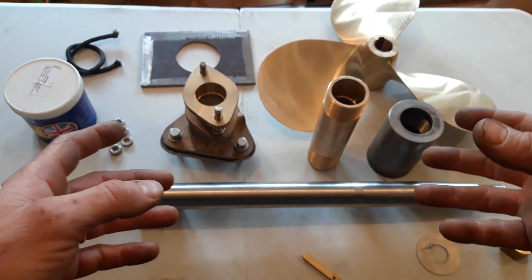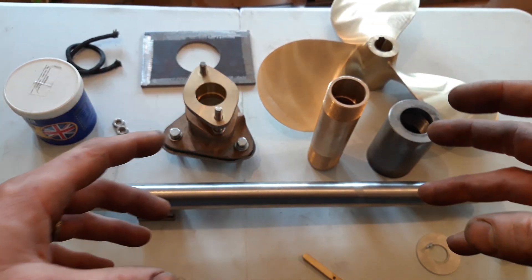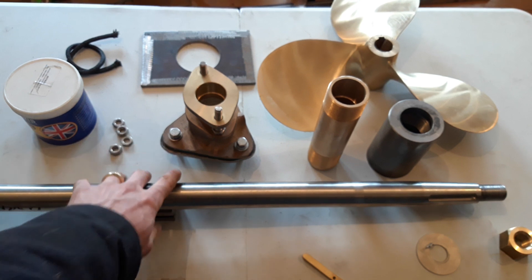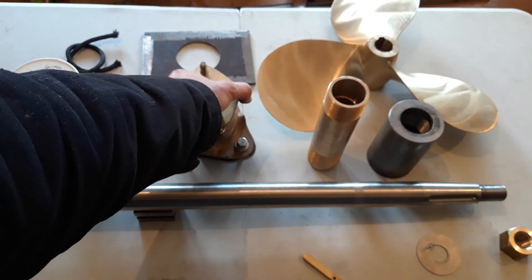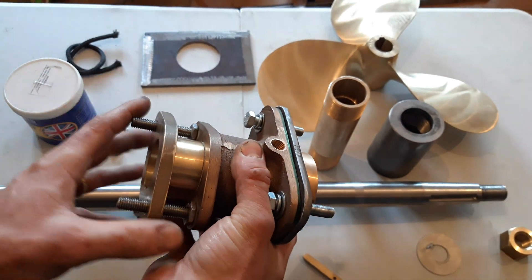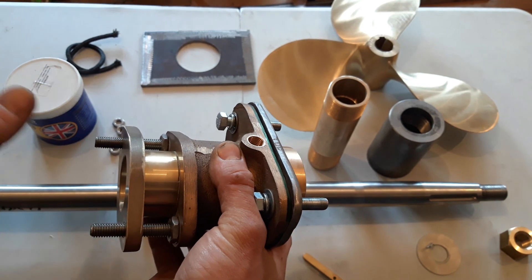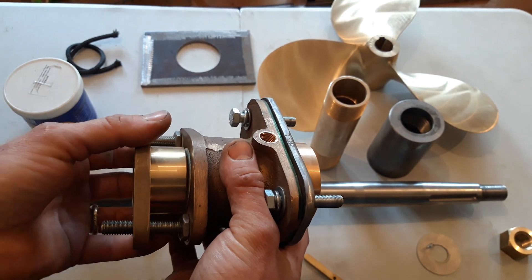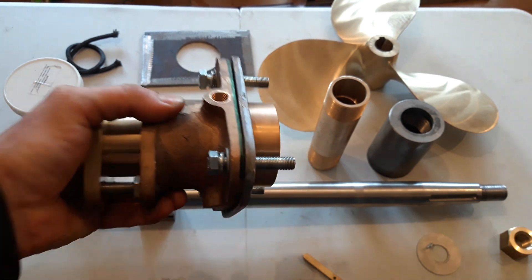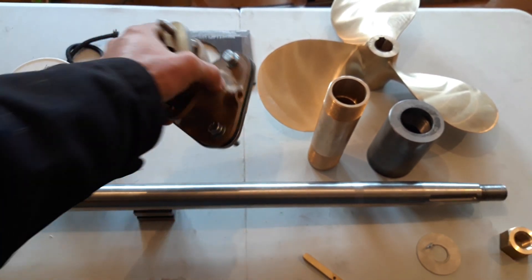There's a school of thought about shaft free-spinning. On the engine system this is going on — a Lister — the shaft won't be allowed to free spin due to gearbox design. With a lot of modern boxes like PRMs, whether hydraulic or mechanical, the shaft can free spin. If you're uncomfortable with it running freely, there are ways to clamp the shaft down. When it comes to repacking a stern gland, you can do it in the water, but it's recommended you don't — especially if you've got a damaged shaft or if your engine alignment is out and your engine is hanging off the shaft.